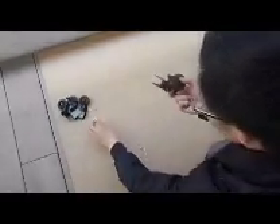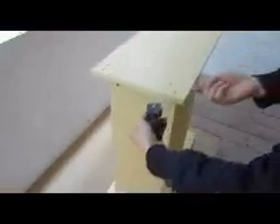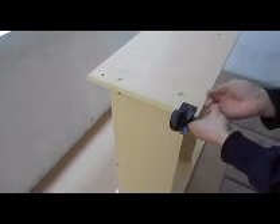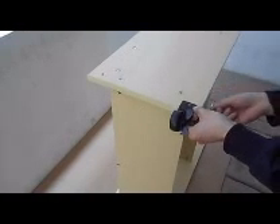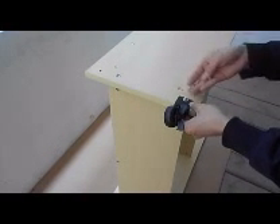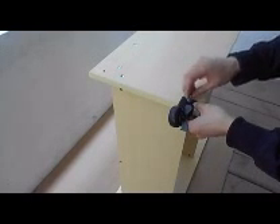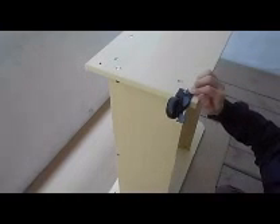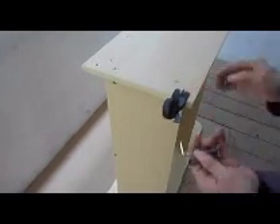The last thing is to put the casters on. There are several washers — you want to make sure you have them to have a tighter fit; the tighter the better. Let the bolt go through the hole and the casters, put the washers on, and then an acorn nut. Tighten this up as much as you can so that it is a tight fit.